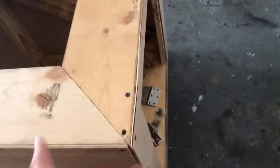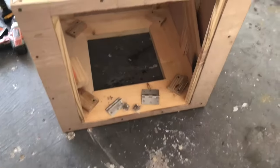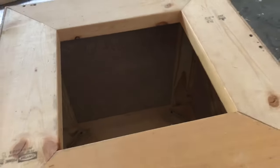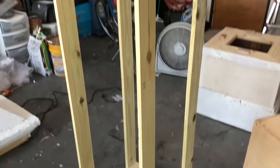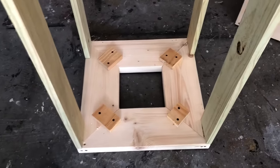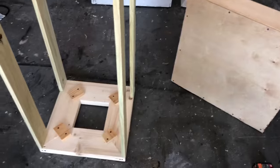I also cut a hole in the back so that I'll have a trap door that I can get into and attach the bolts from each column. You can see the door right there. This is the middle section of the column. Like I did with the base, I used two by sixes for the bottom part so that each section will be able to bolt into one another.